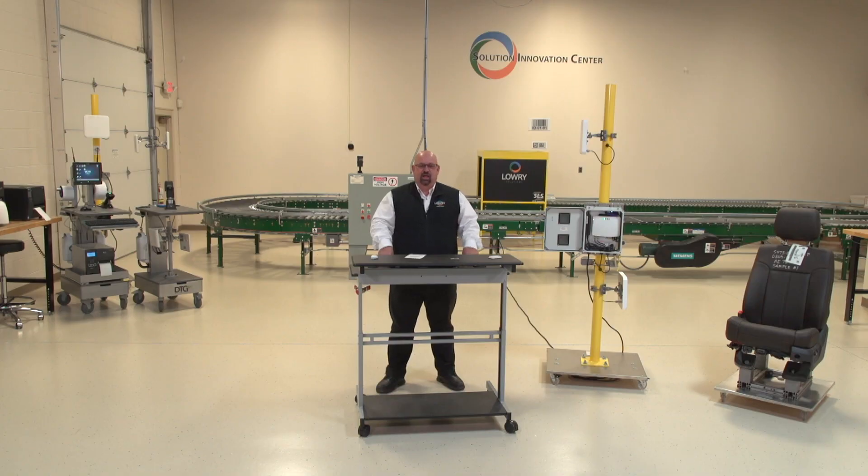The next thing I'd like to talk about is passive RFID and RTLS. This is a little different — it's going to actually divide up the whole facility as XY coordinates. As a passive tag moves throughout the facility, the overhead readers we have installed here, the ATR-7000, will gather that information based on angle of arrival, calculate it, and then present that data to MotionWorks and give you a dot on a map as to where things are.